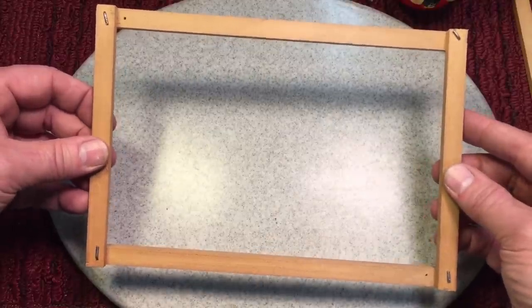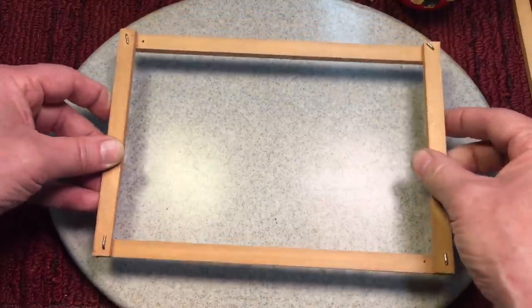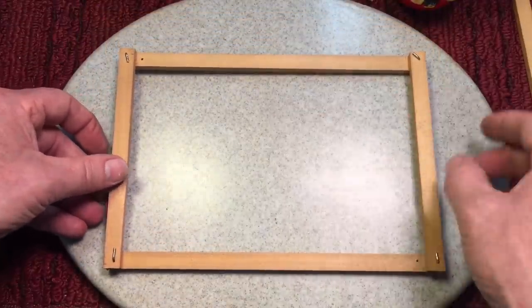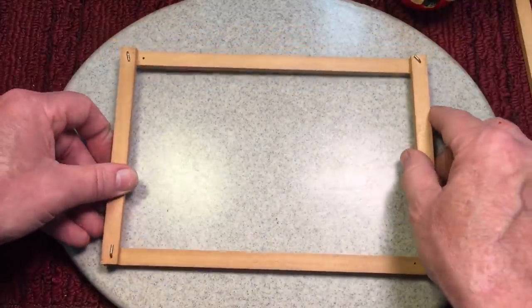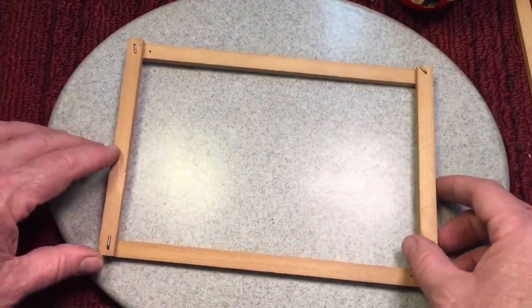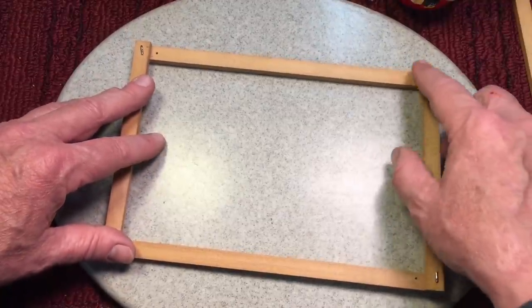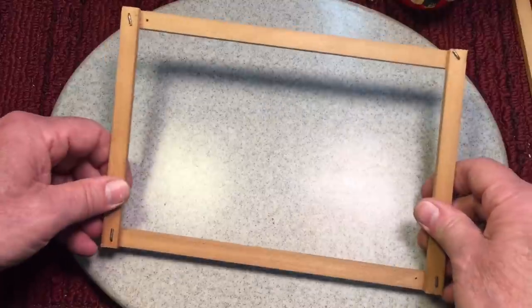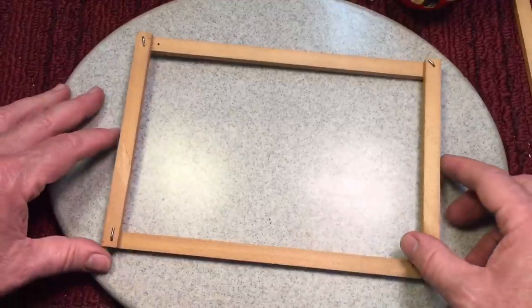What racking is — you see this? In order to fight the rack, they've tried all different ways. They put a brace in the middle, which basically makes it like two boxes and helps the rack a little bit, but it's still able to rack even with that middle piece. So they've tried all different ways to strengthen up gates and doors. We've used gussets — small triangular pieces in the corners to make it stronger. But eventually you'll still get sag, where the weight of the gate pulls down on one side. The longer the gate, the more of an issue this is.